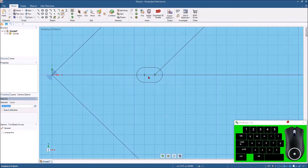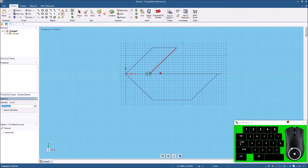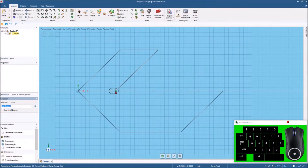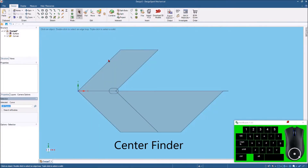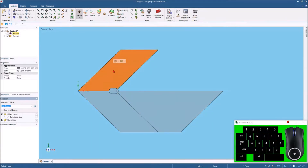That oval is just to give some relief for when we make the corner piece there. Now I'm going to come down to the intersection of those two lines, click on it, and bring another line keeping it at 135 degrees down to the bottom line — that's basically going to be our center point indicator. Now we can turn this into 3D mode.